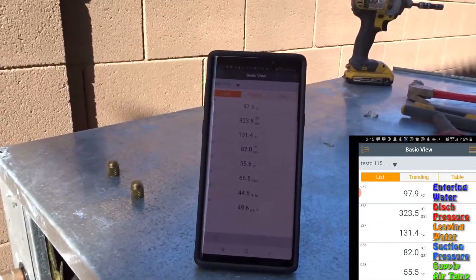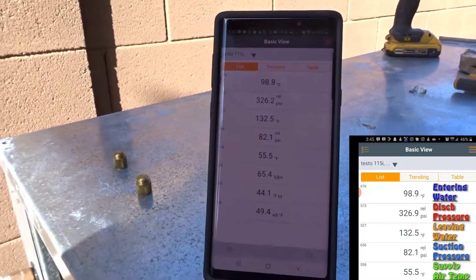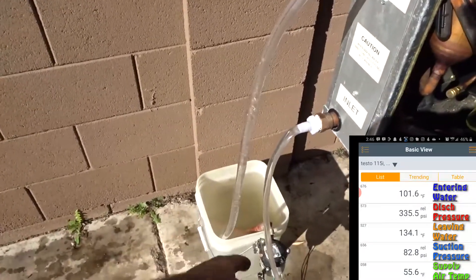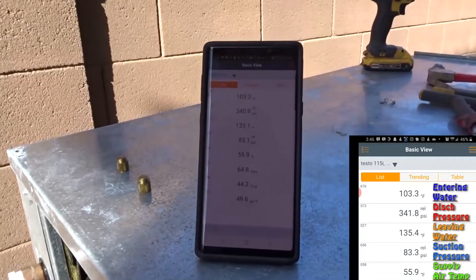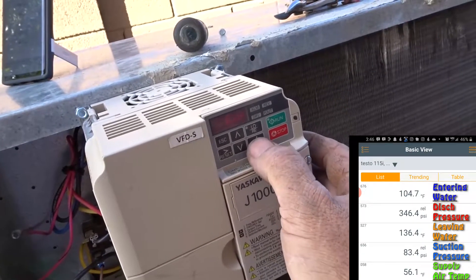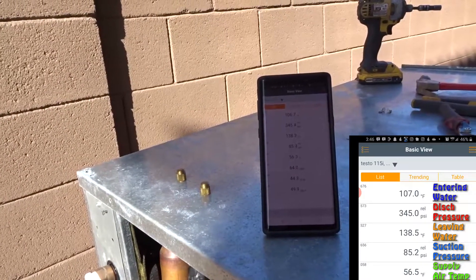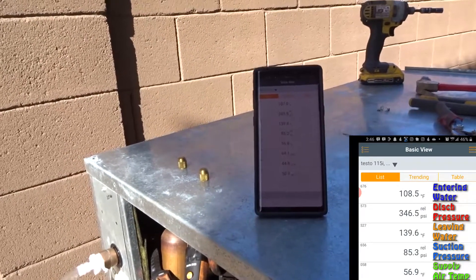323 on the high side, but I think the high side pressure was going crazy earlier with those temperatures. We're not getting as good water flow as before because the fitting — moving around — I think it's leaking and sucking in even more air. You can just see the air coming through right there. That means less water flow. So I think it's leaking. I have somewhere to be tonight so at 342 I'm going to slow this down — dropping to 50 Hz.